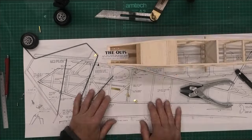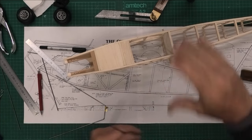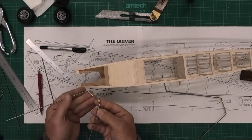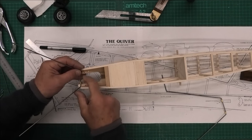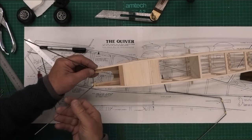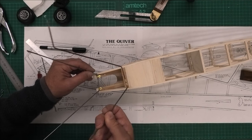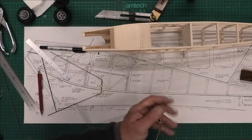Another update - cracking on now. I've got my rear leg completed and it will go onto the piece of beech pointing forward, meeting up with the front piece which I've now bent up slightly thinner. That front piece will attach onto the beech engine bearers, leaving enough room for the engine mounting bolts. I'll need to take out a little bit of the balsa on the side cheeks just to allow it to sit down properly.